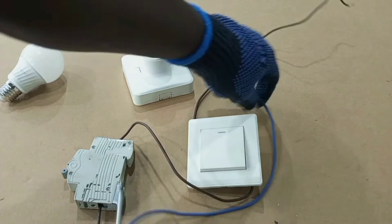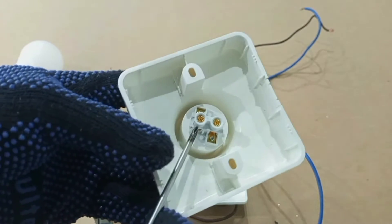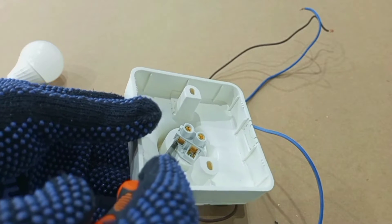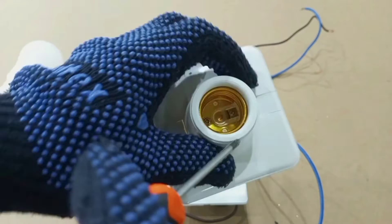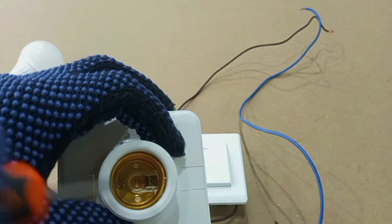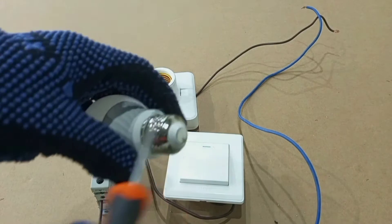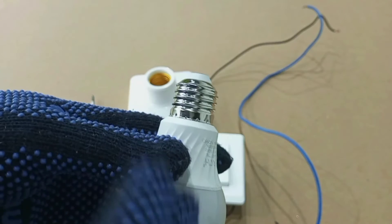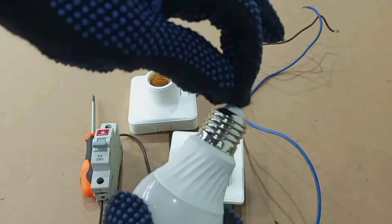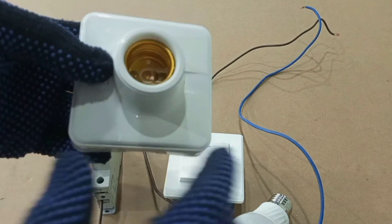This is our switch wire to the lamp and this is neutral from the consumer unit. Now the lamp holder has two terminals — terminal one and terminal two. The cable enters from here, and inside you can see there is one contact at the center before the thread. If you take the lamp itself, you can see a contact at the tip and then the screw thread. The live and neutral wires connect to the lamp from these two points.